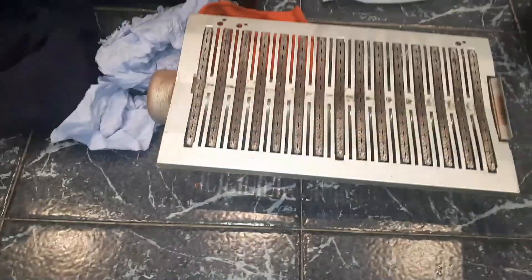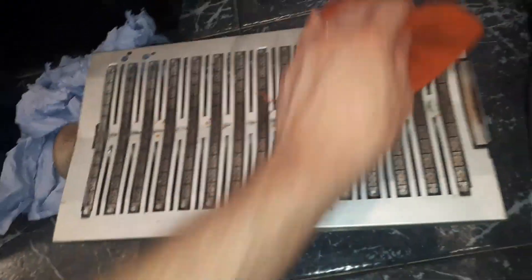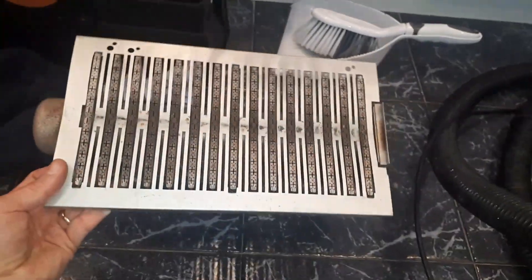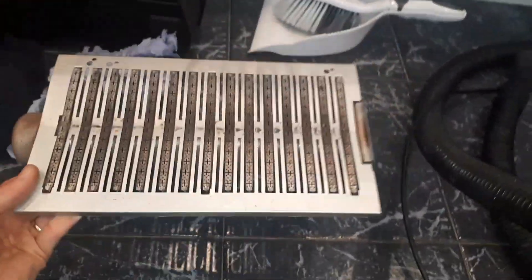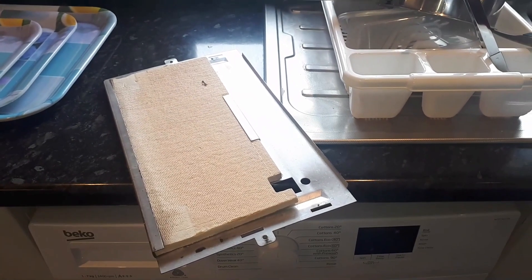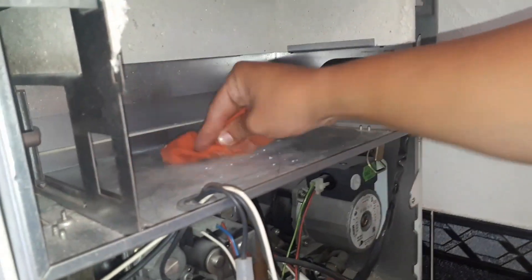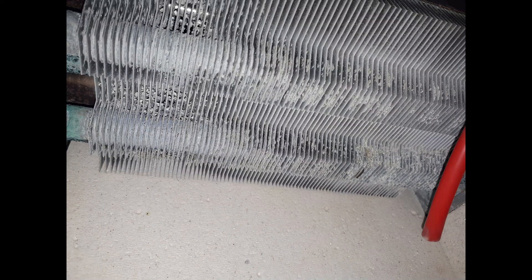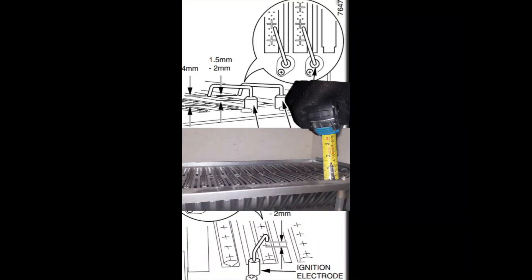Give everything one final wipe down. Check all the insulation panels — check your manual as well: if there's a crack in a panel that's usually a no-no and you'll have to change it, but if it's just a little bit worn in some areas it's usually okay. Do check the manual or give the manufacturer a call. Give the combustion box one last clean — wipe it, dust it, hoover it so it's all spotless. Check the spark gap as per MIs and the location of the electrodes over the burner itself.